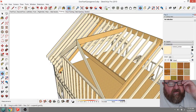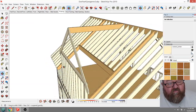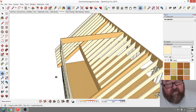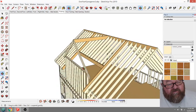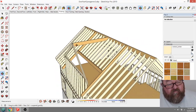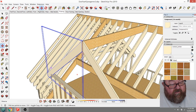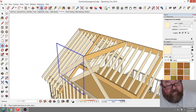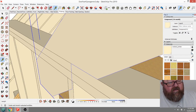This is going to be kind of a lesson for some of my apprentices on roof framing, so I thought I would just make it live in case anybody was interested. I'm framing this now as if it was a gable dormer, but it's actually a hip dormer. But you start off much the same when you're trying to figure out how it's going to work, because you take one of these rafters, and the way you do a hip is you just turn one of these rafters at 90 degrees.